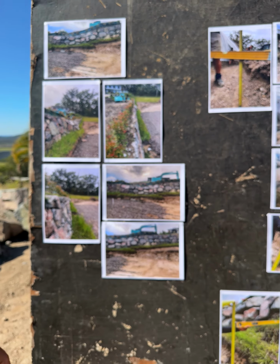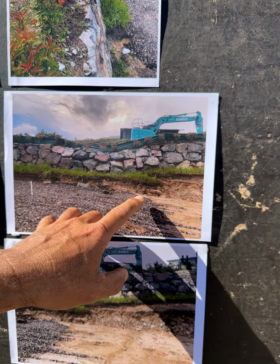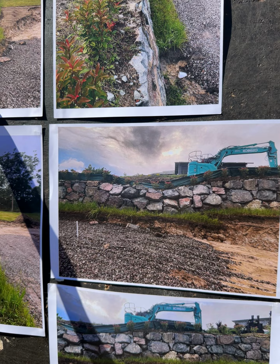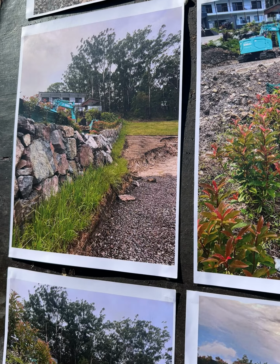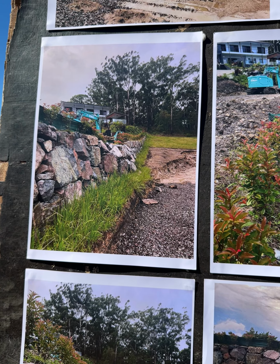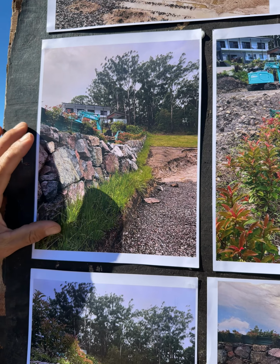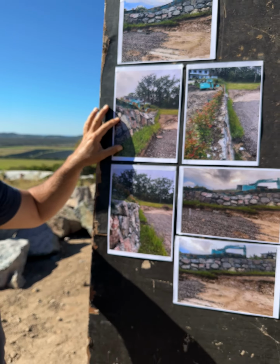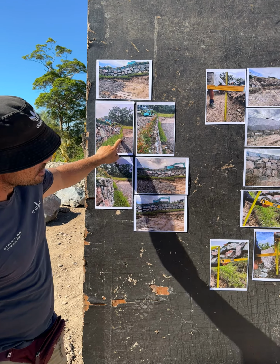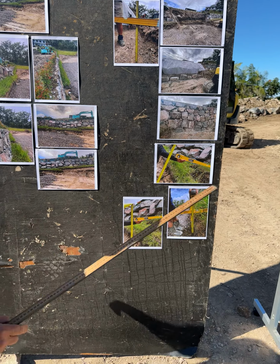All right, now if we have a look at how that's reacted, okay, it's pulled itself down through that pinch point where the cut went from there, where it was parallel up the drive, to there. Now the principle which I was told is they were doing a 1 in 1, 900 out, 900 down, which is absolutely fantastic, but not on the premise that you've got a 2 meter high gravity wall beside it. The other thing that made it absolutely worse, because all this stuff here, as you can see by the tape measure, is still at 900 by 900, all right? Now that all held up.